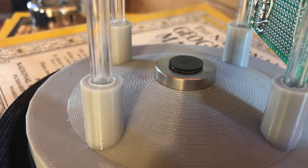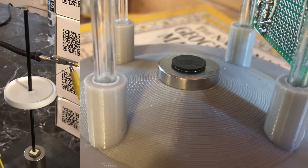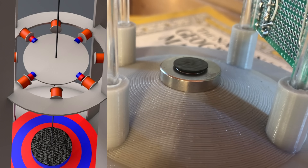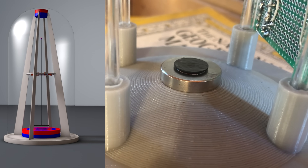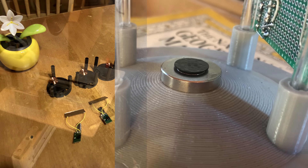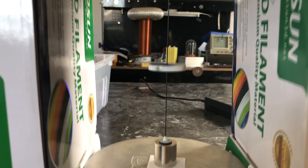I did some simple tests to prove that a rotor could be levitated in this way, and then started on some basic concept designs. I decided to use four magnets on the rotor with eight driving coils. I once again used the coils found in the commonly available solar dancing flowers. I got all the main parts 3D printed and then started testing levitating rotor configurations.